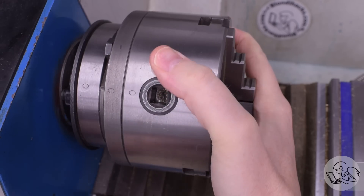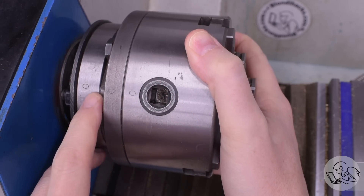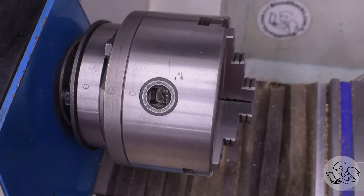I would not want to do that with my three-jaw, however. If you've ever noticed on inexpensive lathes, they always have these three zeros or something similar on the spindle for the three-jaw, and that's because these components are all machined and ground in situ on the spindle at the factory. That's a very cost-effective way to get a decent amount of accuracy and repeatability out of cheap three-jaw chucks. However, what that means is you never want to mess up the alignment of these three zeros — you want that chuck body, backing plate, and spindle nose to always be kept in this orientation. In principle, I could remove the backing plate as long as I get it back on the chuck in the same place.